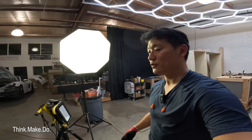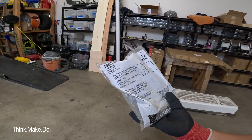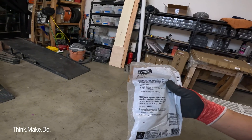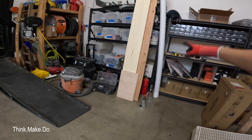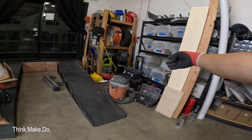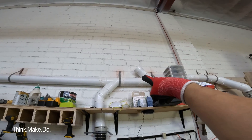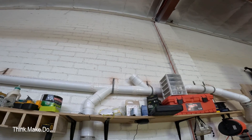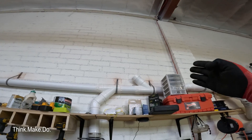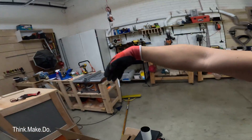I've got some door hinges — actually, where are all my supplies? I've got two heavy duty hinges that are rated for 50 pounds each, so that's 100 pounds total. That is going to support my triangular boom. That main pipe is going to go all the way across the boom arm and attach into my dust collection system off of this Y. The triangle is going to start up there. I've got some plywood I'm going to mount to the wall to make a drillable surface for the hinges. That makes it kind of easier to install. It's going to probably swing out from that direction, out this way, and drop right here.